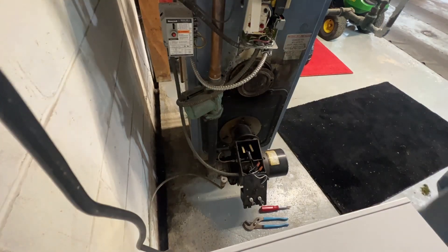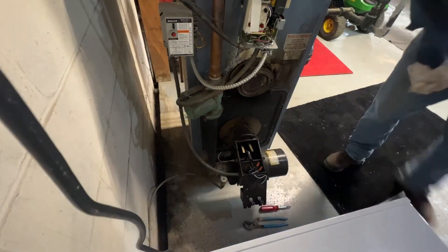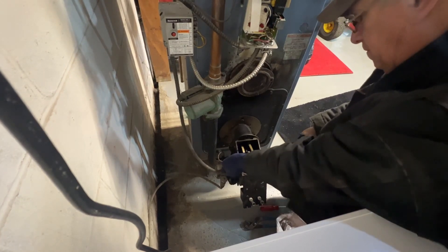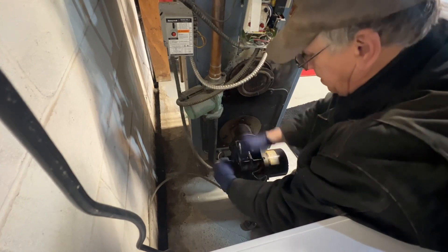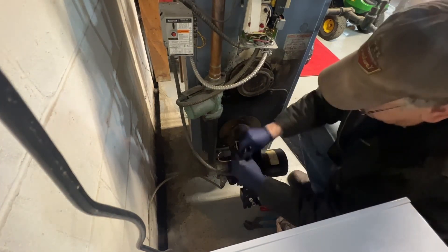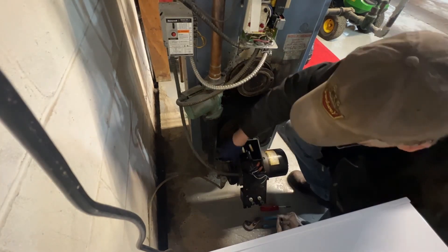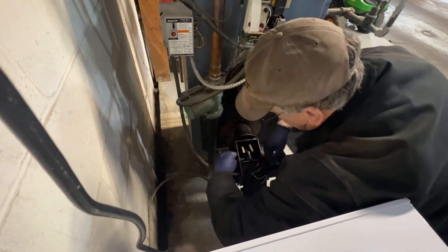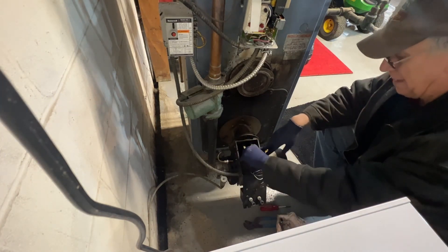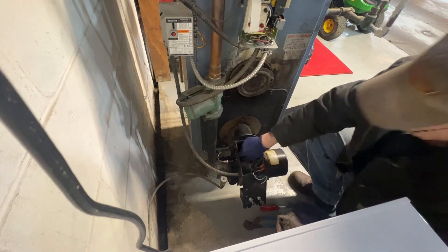I want to get a pair of gloves and a wrench. We're gonna check that and see what strength it has. They make a gate thing you put on there to test it — a checker for the electronic ones. I don't have it. I always do the screwdriver test, but some of these are harder to tell on the electronic ones. It's easier on the iron core — I much prefer the iron core. The problem here is that this is constant ignition; it doesn't drop the transformer out, and these electronic ones don't hold up well to that. It's getting harder and harder to get the Wayne burner serviced by somebody.